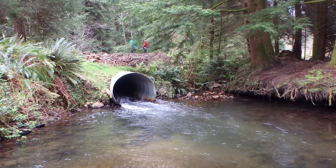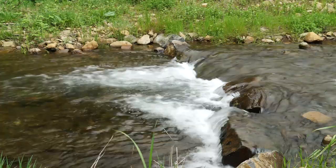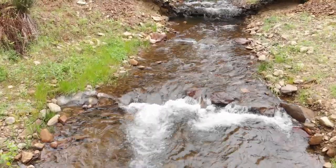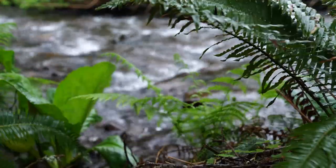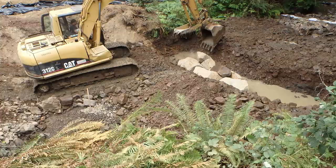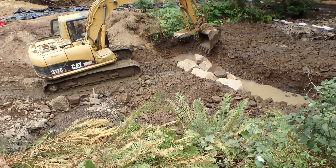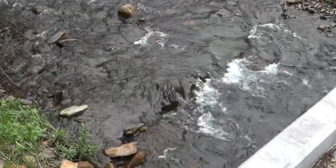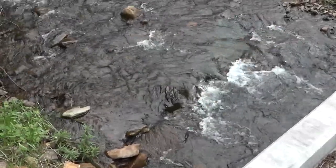The problem was undersized culverts on this property. It's a salmon-bearing stream, and this will allow access of fish upstream, particularly in the summertime during low flows. Each weir was embedded into the stream bed, allowing about a six-inch jump for juvenile fish during the low flow periods.